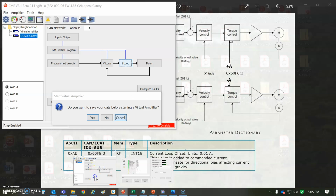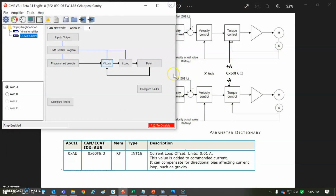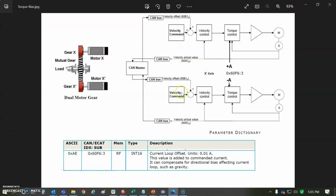So just gonna double check that I did that. Yeah, with no integral, a little bit of steady state error allows the bias to show through. Maybe we should use some integral, so that's okay. It's just that it will counteract the bias effect.